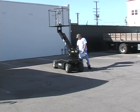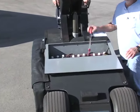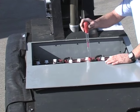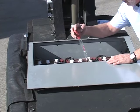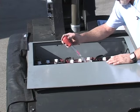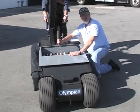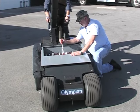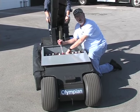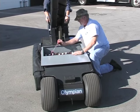Now I need to get in and check the batteries. To check the batteries, you pull open this compartment on this crane. We have a hydrometer with each crane. You pop open the battery top, draw the fluid out of it, and it will float and tell you, like 1225, 1250, 1275 — 1250 to 1275 is a full charge. You want to try to check every battery before you charge the crane. It'll tell you what state it's in. It also gives you a chance to check the level of the battery. The battery should be filled with distilled water only, about an eighth of an inch under the lip. You don't need any more than that or it will gas and leak battery acid all over everything.